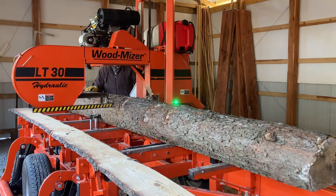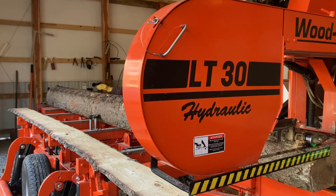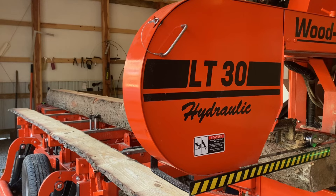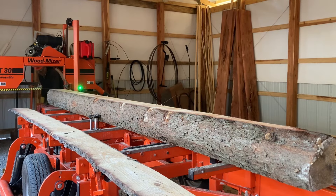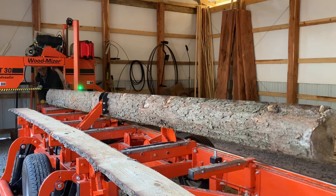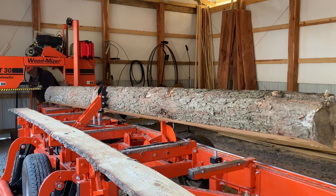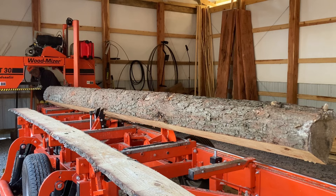To try to keep the video from being too long I've edited some pieces out on the cut and the return of the sawmill head, since we're cutting full 16 foot lengths. Most of you are probably thinking I need to take another fletch cut off of that just to get down to squaring it up, but I'm trying to leave as much material on here as possible just in case these start moving - I mean bowing or crooked - as I cut them loose out of the cant. So I'm trying to leave just a little extra material so I can take some skim cuts and possibly square them back up. We're going to roll this thing one more time and take another slab cut off and see how that starts looking.